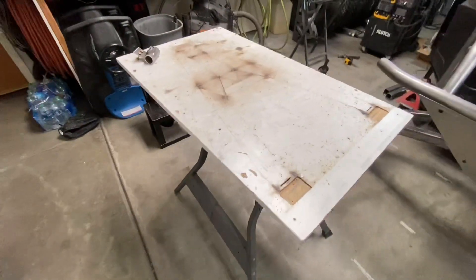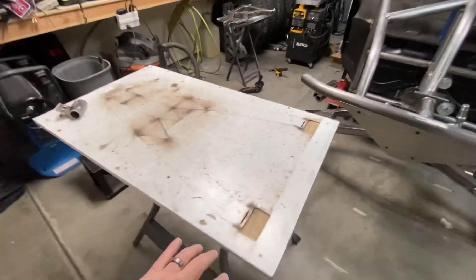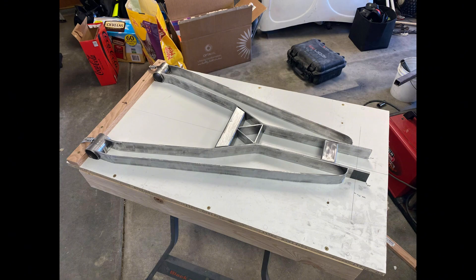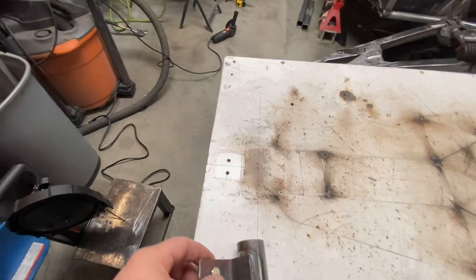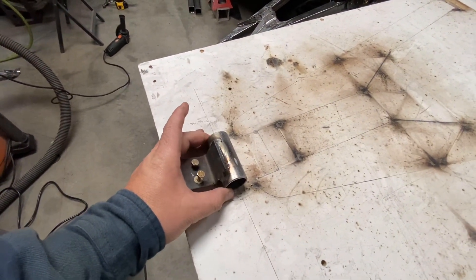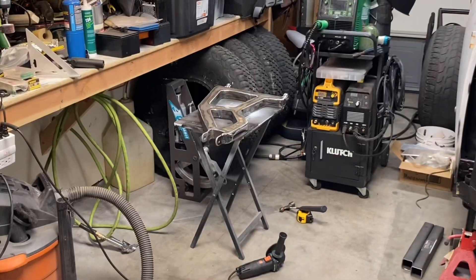This is the board I used to manufacture the lower arms — this was the jig. It didn't look like this when I was using it. It had a bunch of pieces of wood screwed down to it, and I had slots routed out for where the pivot tubes went. You can see it's been all marked up where I was welding on it. On this end I had this bolted down, and it was setting the spacing between the pivot points for the uniball. So I'll do something similar for the upper arm — flip this thing over and get going on another upper.